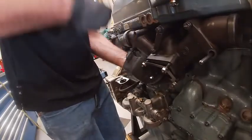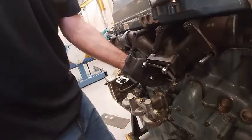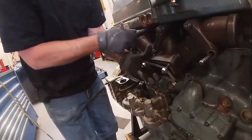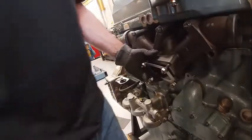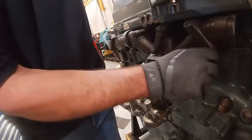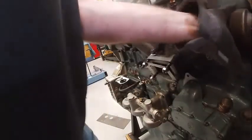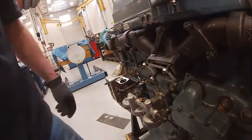We'll take our guide bolts out and put another bolt in there. As I put all those on, I'll torque them. Get that one started, then I can put my front section and my other gasket — I'll have to fish it in. This one's fairly new; usually they don't come apart that easy.